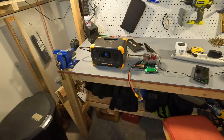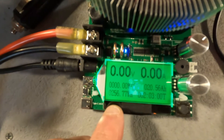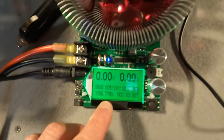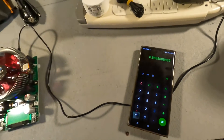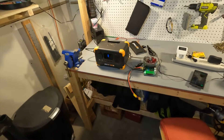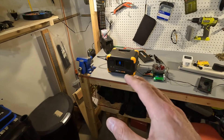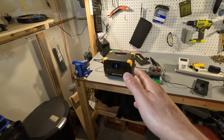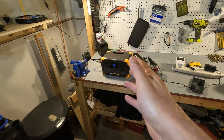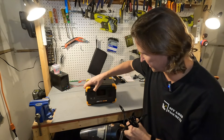The DC capacity test results show 256.77 watt hours out of 288 possible, giving an efficiency of almost 89% — very respectable. With the unit charged back up to the upper 90s, we'll do some heavy draws on the DC side and test the AC outlets to see if we can pull 500 watts from one outlet and observe what happens when we exceed the limit.